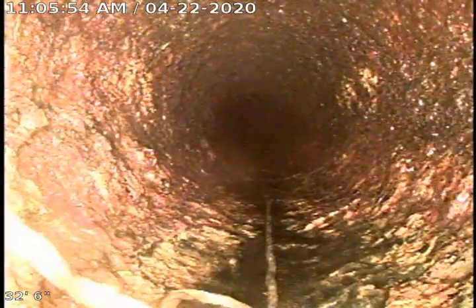This whole section of the pipe here appears to be in pretty bad shape on the bottom. If you look right here on the bottom, it seems like there's a crack right there on the cast iron. You can see it just in the bottom left-hand of the screen. I'm going to mark this spot as well.